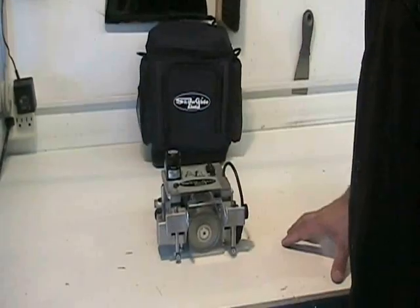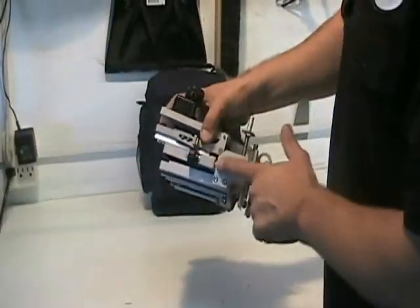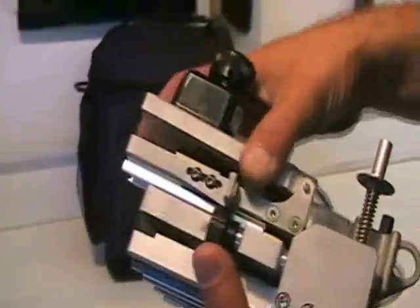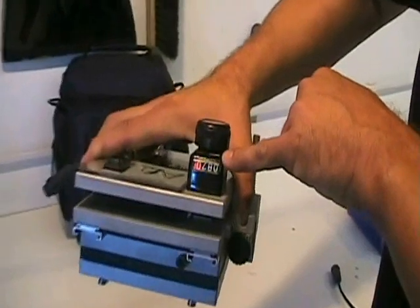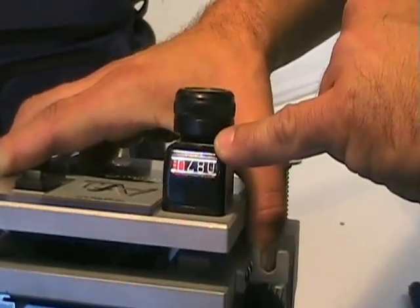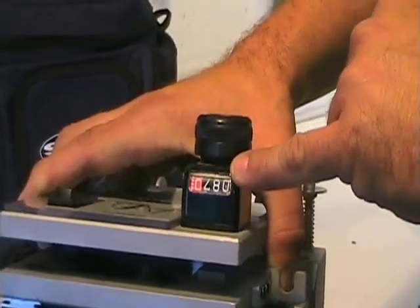This is the snow glide machine set up in the side edge mode. This bolt here on the left hand side of the machine — the large bolt with the black knob on the top — keeps the upper trays and lower trays connected for the side edge mode. Your edge angle is set here. Remember it's an effective angle from 90 degrees, so 87 would be 3 degrees, 88 would be 2 degrees, 89 would be 1 degree, and 90 is obviously 0 degrees.